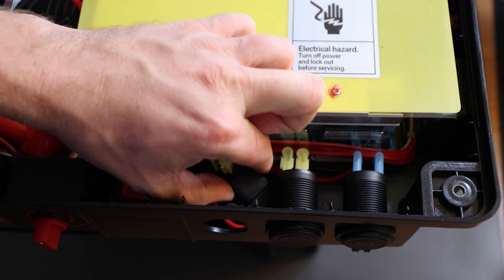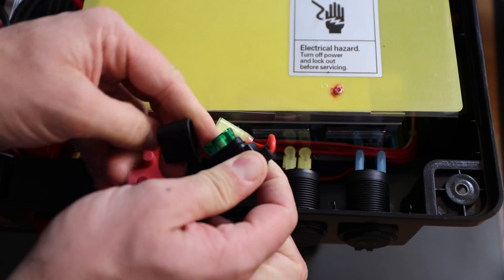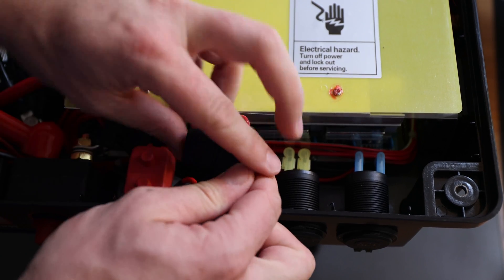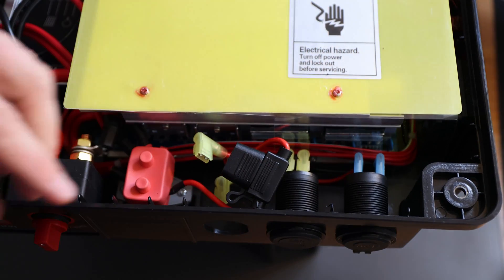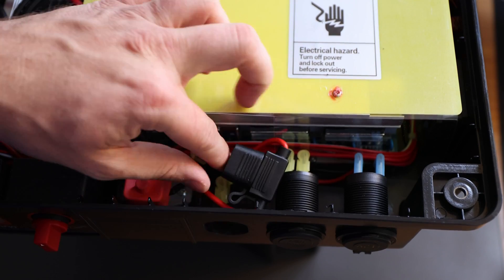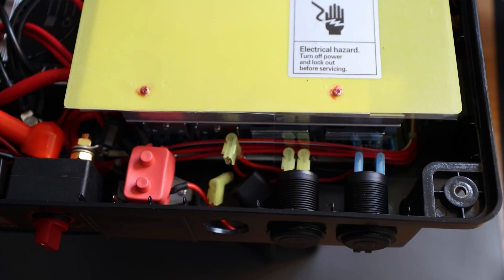What I checked in here is that there's a little fuse at the beginning. When you open this up, you can see it has a fuse in there — it's a 30-amp fuse. That's enough, because we have 10 amps for each of the three slots, or one of them can use the entire available current. That's the idea, and it should be sufficient when using it with the new plug as well.